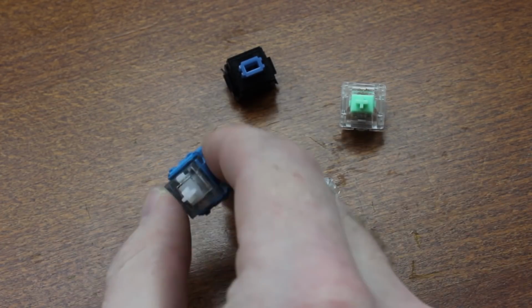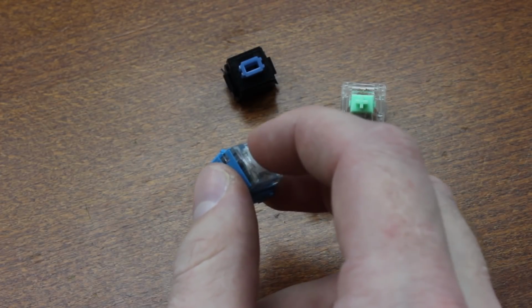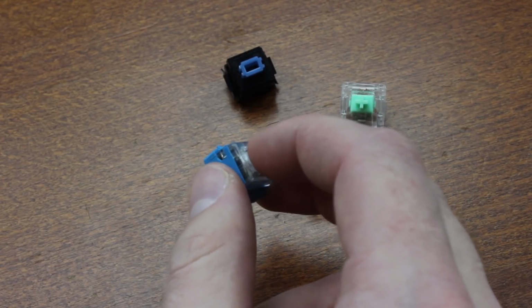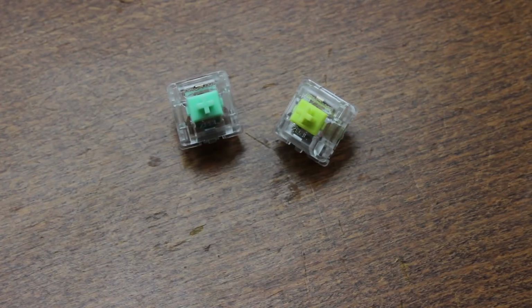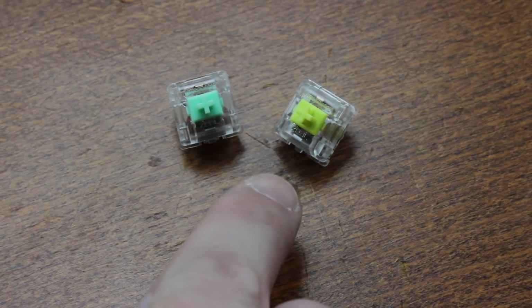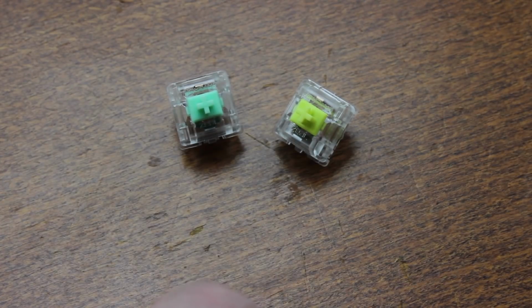There were also iRocks switches, which combined Alps and Cherry elements, but that one was really more of an Alps-type switch with Cherry keycap mount rather than a Cherry switch with an Alps-type leaf. Because it can be easily interconverted between clicky, tactile and linear modes, Zeal refers to it as a 3-in-1 switch, and they come in 60 gram and 100 gram weightings. It's a really cool idea, and I'm looking forward to giving you my opinion on them in a full review.